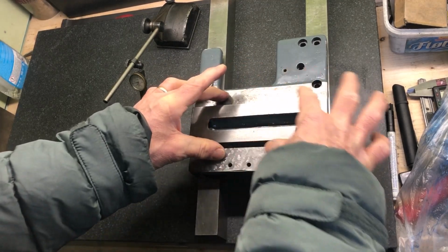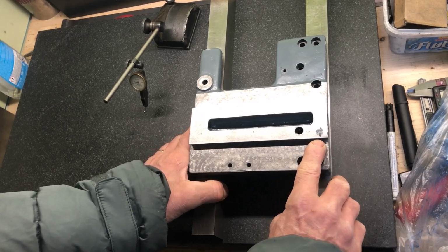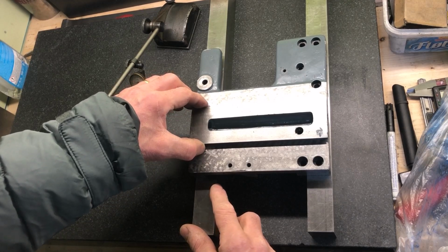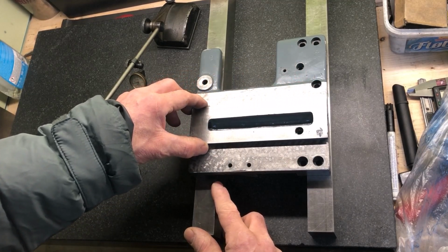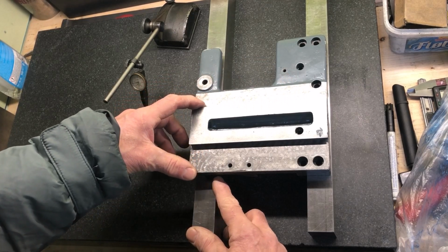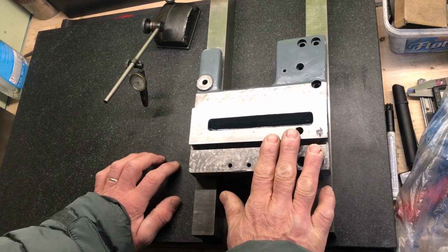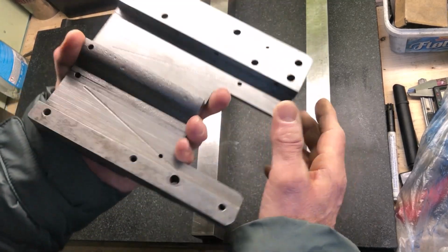So I'll use time to flatten this to the lowest level here, taking off 2 or 3 hundredths of a millimeter here on the rest and here. And then I also then during this process, of course, using pins, ascertain that I have some form of near perfect alignment between the ways here. At least that's what we need to establish at last. And then this surface is also quite okay, actually. Not so on all specimens of this type of lathe, but anyway, this one was.